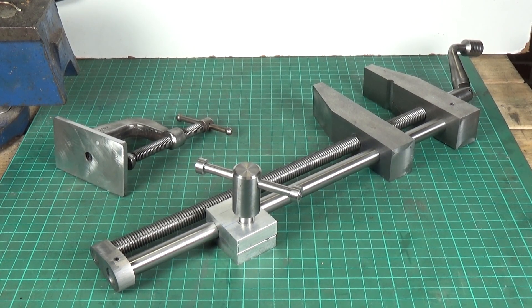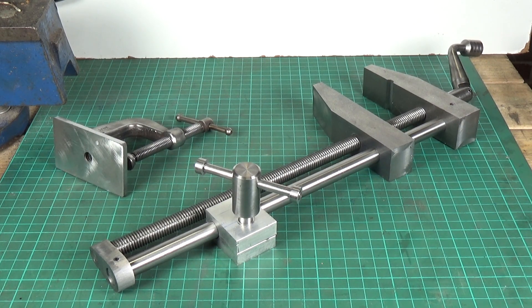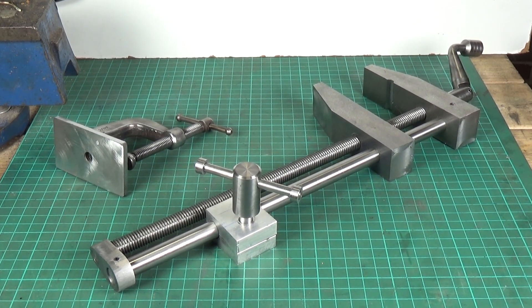The float lock vice is now officially finished. I opted for Mr. Pete's method with the clamp. I had a Record two-and-a-half inch G clamp made of steel, chopped the end off, and I've actually brazed it onto the bottom plate here. I'm not going to show you the brazing because it's appalling - that's my first attempt at brazing. People like Rob, whose channel is Zunudu, make brazing look really easy and it isn't. It's not very pretty but it's strong. It's taken properly in a few places but not all the way around, but I tested it and it's perfectly rigid and strong and holding well.